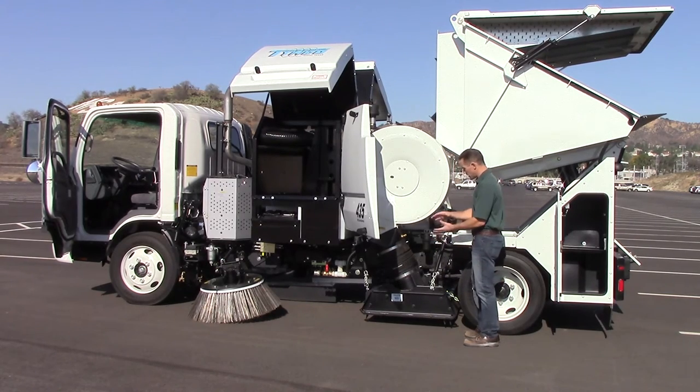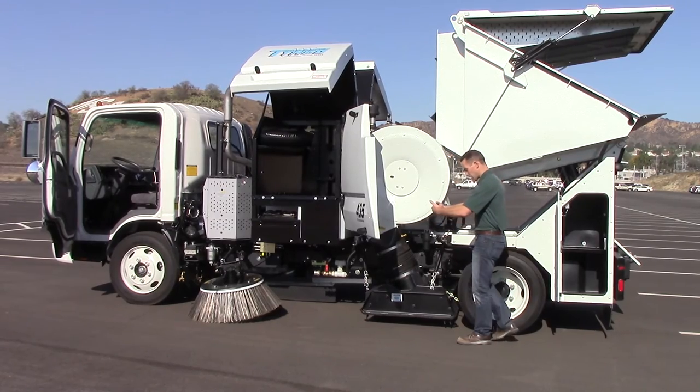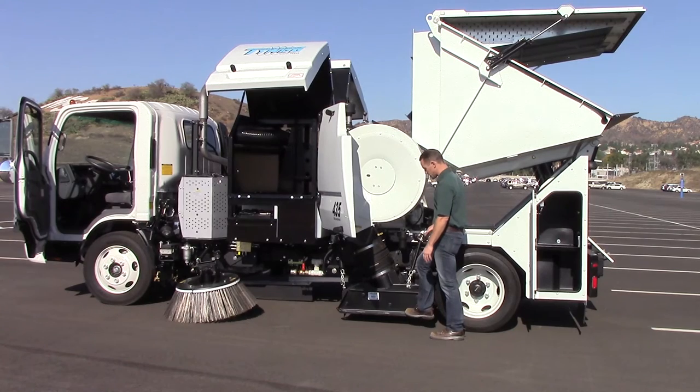The pickup head has got two chambers in it. The top chamber runs the width of the head, and then there's a bottom chamber, which we call the work chamber. On the bottom side, there's a blast orifice that runs from about three-quarters of an inch to five-eighths of an inch — a little bit of a taper to it. So this blower wheel is forcing air into the pickup head, creating a massive amount of pressure, and then it comes out of the blast orifice, creating a huge amount of velocity, and it air blasts the pavement. When operating, this pickup head is all the way on the ground, sealed on each side with these carbide runners or carbide skids.